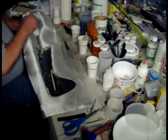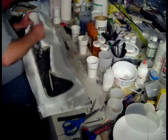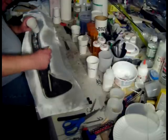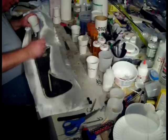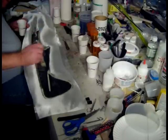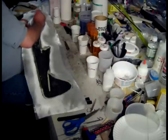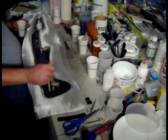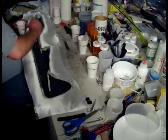Once you've got that 1.4 ounce cloth wet, it helps wet the 6 ounce. But you have to be careful on the back half about loading up too much resin, because you can't get it out once you get it in. On the front half we have a doubler that's going to soak up some resin. I've got a little wet back here, so I'm going to soak some up and move that resin up front. The way you do that is basically just pat it out, let the brush absorb it, and move that resin to a different place. It's not surprising how much resin you can draw out with the brush. Nonetheless, it's better not to get too much in the first place.